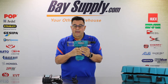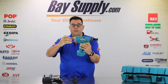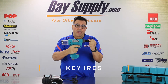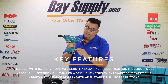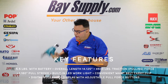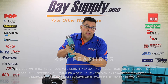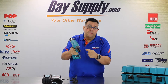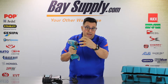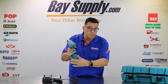The tool has a removable pintail or mandrel collection bottle. It's a 5.5-pound tool with about an inch and an eighth of pullback stroke. It's got a nice belt buckle adapter to hang on the side of your belt. It's got adjustable power — one of the only tools on the market that has the ability to control the pull power, the pounds of traction power, with three buttons and digital controls.